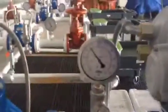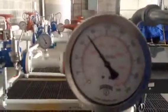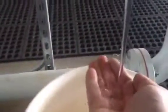I'll be able to show you this just once. As you can see here, the valve is perfectly stable. We're sitting at 70 psi downstream, and upstream we're sitting at 110 psi. Once again, 70 down, 110 up, with water flow just running off of my hand. It hardly even splashes as the water's coming off of the valve in this little bypass.